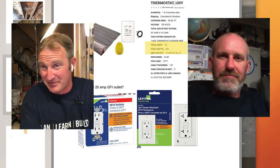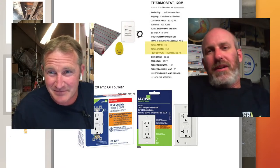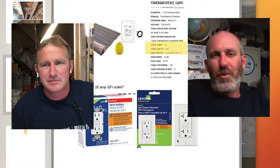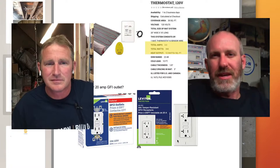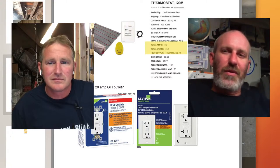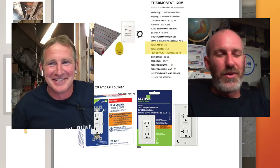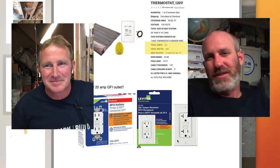It really comes down to the rating of the appliance you're using. If you look at the actual wattage and power consumption, it's never going to exceed 15 amps — most hairdryers are around 11 amps. A 20-amp outlet is more of a rugged type for constant use, like a hair salon. For your bathroom with just occasional hair drying, a 15-amp GFI is sufficient. It won't hurt to go 20-amp, but it's not necessary to spend the extra money — a good 15-amp GFI will last just as long.